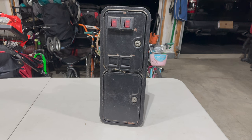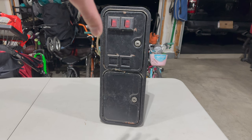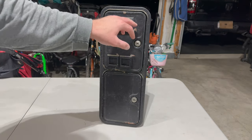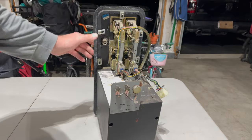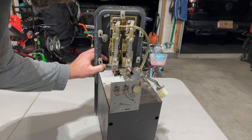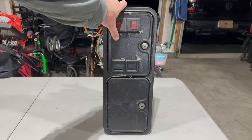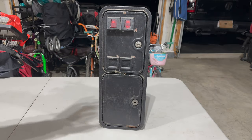Back on the Pango. The first thing I want to do is restore this coin door. We're going to take everything apart, take all the parts off, strip off the black paint because there's a bunch of flaking parts with rust coming through. Even on the inside there's flaking paint that I don't like at all. We'll strip it down to bare metal, sand it all off, paint it with hammered finish, and then black paint on top.